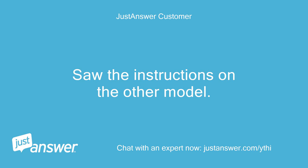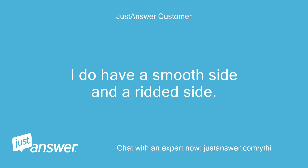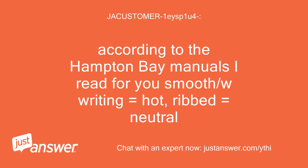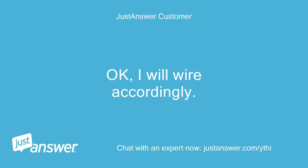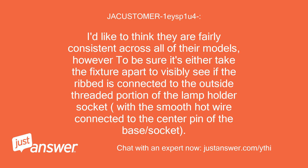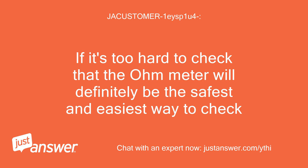I do have a smooth side and a ribbed side. The letters are printed on the smooth side. Does this matter, as I thought the side with the printing was supposed to be neutral? According to the Hampton Bay manuals I reviewed, smooth with writing equals hot, and ribbed equals neutral. Okay, I will wire accordingly. I'd like to think they are fairly consistent across all of their models. However, to be sure, it's either taking the fixture apart to visibly confirm that the ribbed is connected to the outside threaded portion of the lamp socket, and the smooth hot wire is connected to the center pin — or use the ohm meter, which will definitely be the safest and easiest way to check.